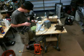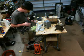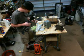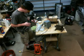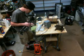And now I have O-rings in between my electrodes where the connection is going to external, and now there can't be any electricity passed between here. It has to go through the cell. Even if it has to go around the outside and back in, since the bottom one is closest, that won't even be a factor. For this particular application, you don't want that to happen. And that's how I've resolved the issue. So take note of that.